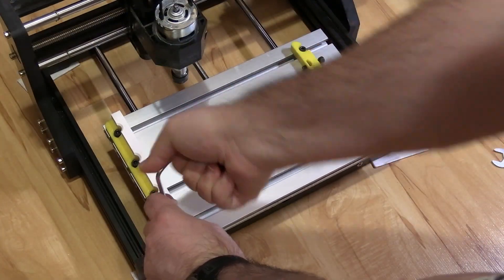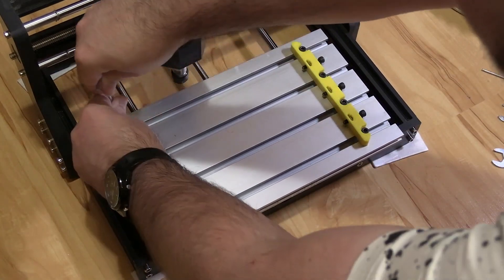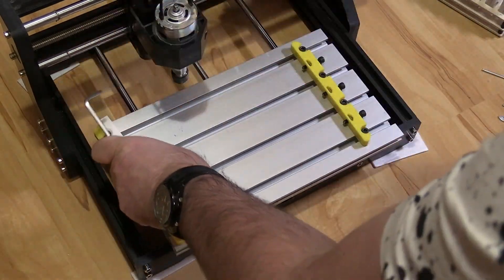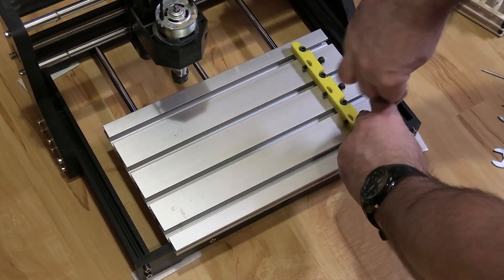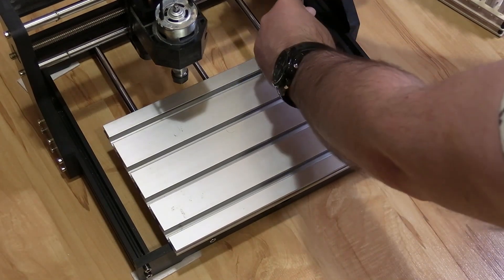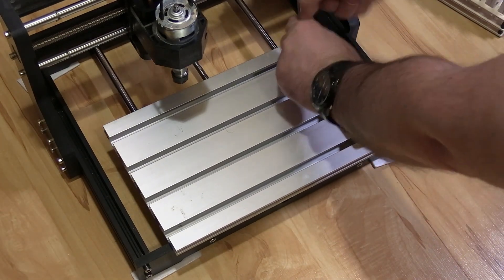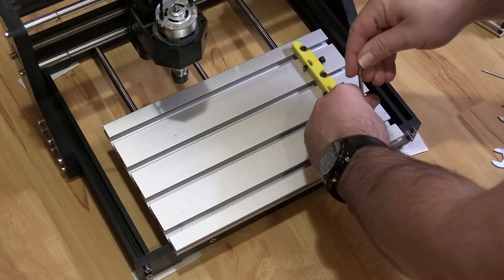And because you can use those pseudo-parallels I also designed, you can elevate your work from the aluminium and cut and engrave using the same tool. Can we call it a success? Well, to some extent definitely yes, because it's cheap, you can do it at home, you only have to buy some M5 bolts and T-nuts for the assembly, but besides that it's working just fine and holds wood, plywood and MDF boards on your router without absolutely any problem.